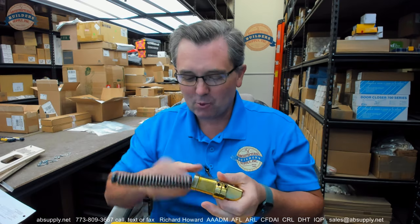Then you follow the same rules that you would follow when you're prepping for regular hinges. If you put it on the door at 7 inch, just making up a number, from the top of the door to the top of the prep or to the center of your prep, whatever you're referencing, you've got to make sure that on your jamb, you add an eighth of an inch to that dimension, because you need an eighth of an inch gap at the top of the door. So if your door is 7 inch, the underside of the header to that same reference point is 7 1/8.